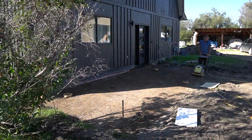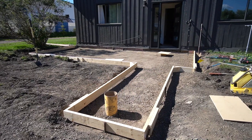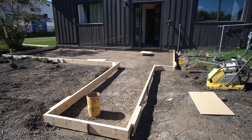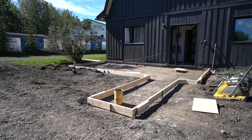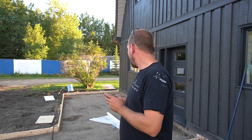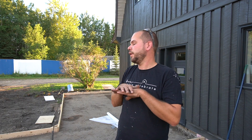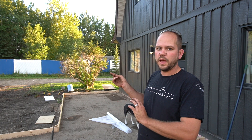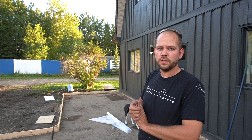Because we were planning for five inches of concrete, we used two-by-sixes, which are five and a half inches tall, to make a form around the concrete pad. The next step was plastic and rebar — I put some poly down on top of the gravel, and that's what the concrete is going to get poured onto. Once the plastic was down, we could lay the rebar and tie everything up ready for the concrete pour.